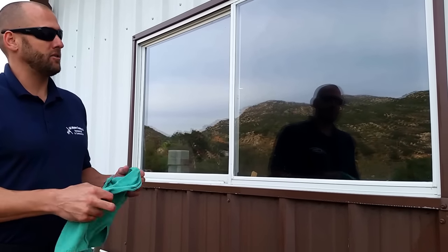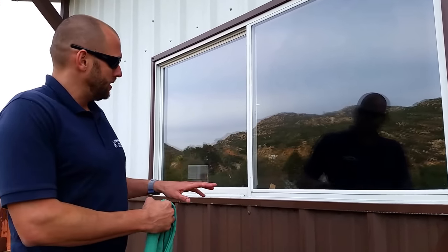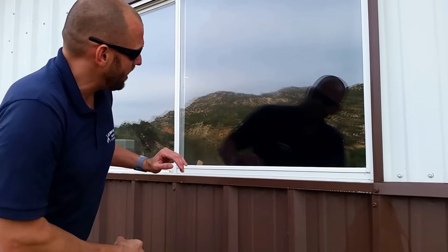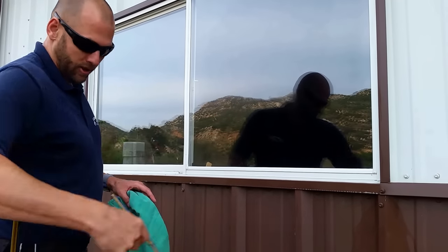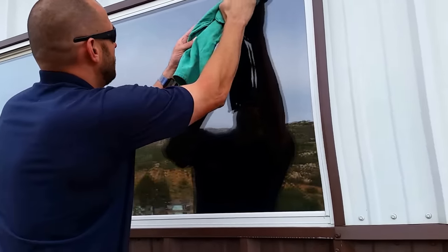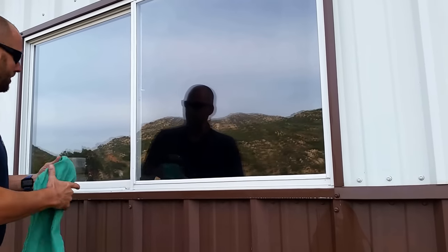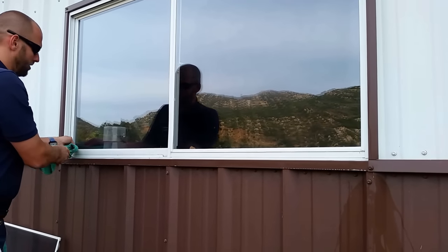The final step, step five, is to detail the window. I could use one to two of these rags for an entire job because there's nothing on this glass now. I believe I left a little Nike swoosh mark here — I could wipe that down if it doesn't leave lint. If it leaves lint, you may want to use a smaller blade and redo it there. So now you're just gonna rag any marks that you actually left. It's important to remember that if you've pre-ragged the window, you're really not going to have anything to detail — barely any. And as your skill progresses, you'll get better and better at it.